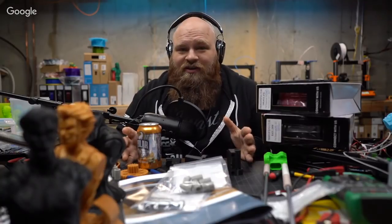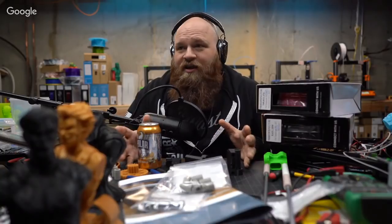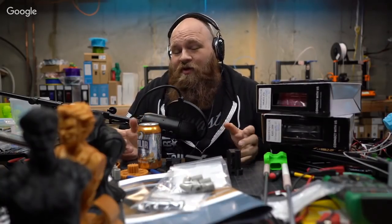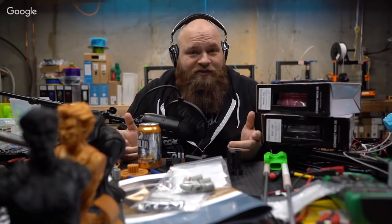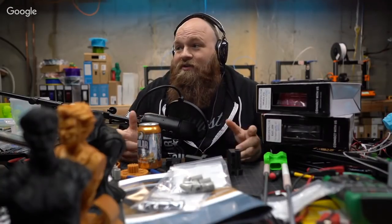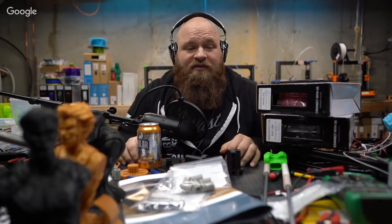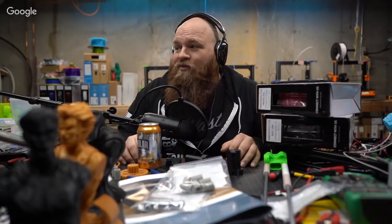So basically, I'd love to make a Marlin firmware that works stock with that board to work on a Mark IIs or a Mark 2.5 even, and then you have silent stepping and all the other features, and it's 12 and 24 volts, so you get to keep your fans at 12 volt versus going to 5-volt fans on the Noctua and all that fun stuff. So that would actually be a fun project.